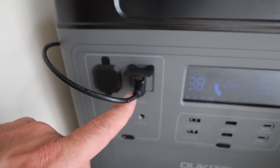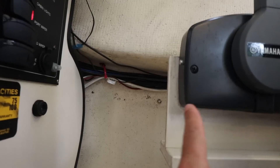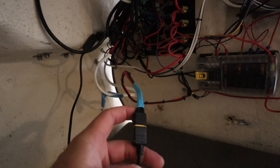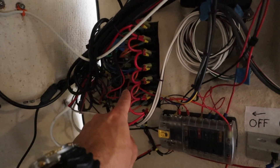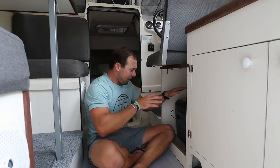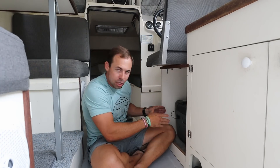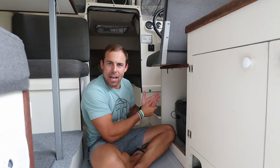Then I have this wire coming out of my XT60 plug, and it's ran up the same direction, up through these wires, and right out here to this mess. This is the plug that I had plugging into another power bank — the smaller one I would use — and this feeds my sub panel. It has a main switch where I can kind of turn it on and off, or I can also power up this panel here. So I can either run just my accessories and some lights, or I can make it run the major stuff on the boat as well. I think the only other change I may do is put some sort of padding around this thing so it doesn't shuffle around while I'm underway. I want it to be secure, and I don't want the wires bumping into the bulkheads.